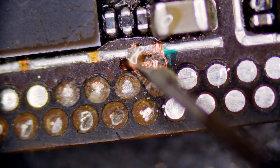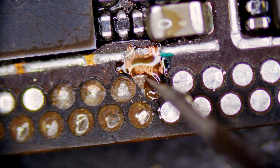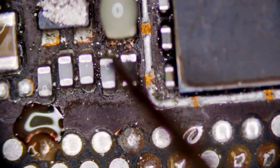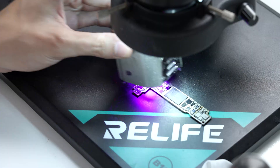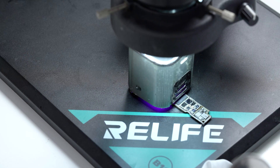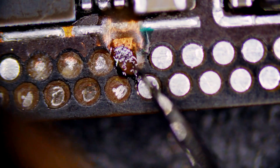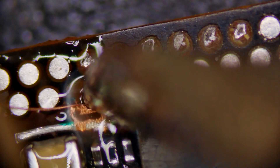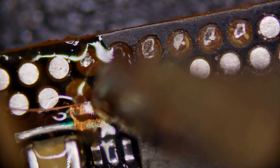Let's insulate the grounding plane with some UV solder mask, so we can tie into it without worrying about potentially grounding out the line. We're going to cover up all the other joints that aren't necessary, then hit it with the UV light. Carefully apply some solder paste so that we can tin that trace — it's extremely tiny. All we need is for it to tie into a small jumper wire. We'll carefully use our iron until we can get it to make contact.